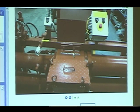Some of the faults on this, is it gonna be going through SCADA, or are they gonna go through the hard panel on the press? We'll cover the faults, but yeah, it goes through the SCADA as far as I know. I mean, everything's going to be on there. So if you shut down on your Schwing maybe, like a high temp or low oil or something, you're still gonna get a message somewhere? Yeah. Well, it's definitely going to come up on my HMI, and it'll come up on your SCADA screen. Everything that's on the pump screen is on your SCADA screen.